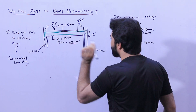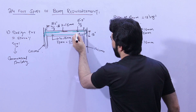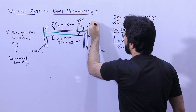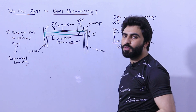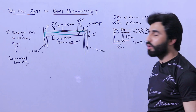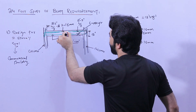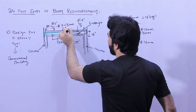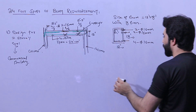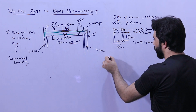If you need to provide lapping length, lapping is allowed at the top at the middle of the span. However, lapping is not allowed at the bottom steel reinforcements. Lapping should not be provided at the distance of L by four at the junction between beam and column. If required at the middle, lapping at the top portion should be provided at a distance of L by two.